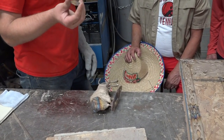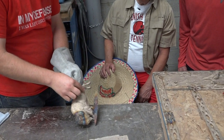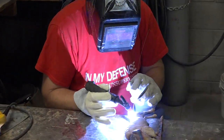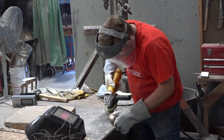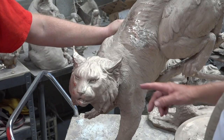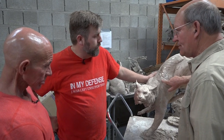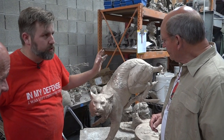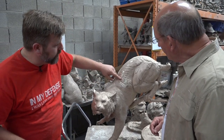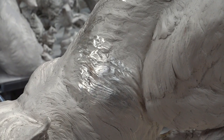Over at this metal table, we're going to fix the piece and get it looking like the original. Earlier we talked about holes in the sculpture for airflow so the slurry will dry — now we've got to put those holes back together. This was cut out in wax and gets welded back on in metal. After welding, pneumatic tools are used to grind off the weld and make it look like the original clay sculpture. This beige color is actually the real color of bronze — when you see it brown, that's a different effect. There was a seam going right through here and it's been refinished to look like the original clay.